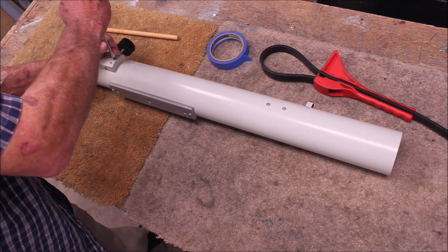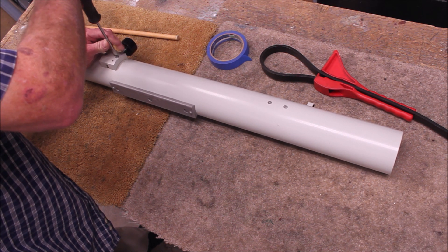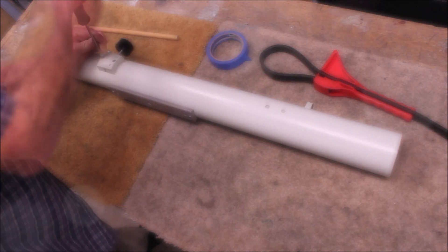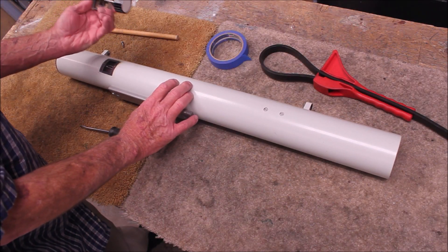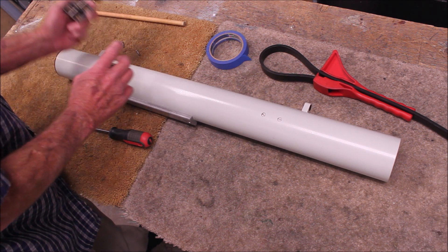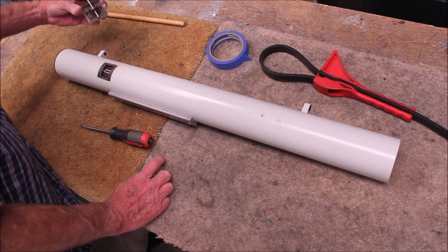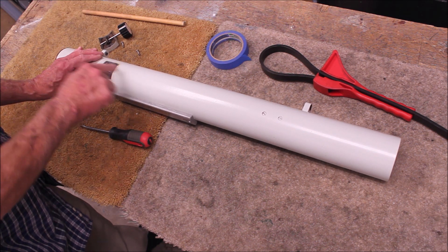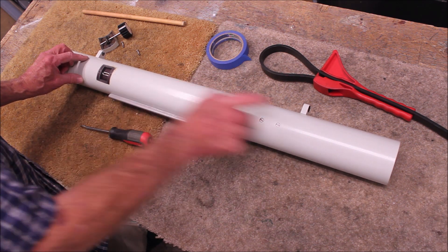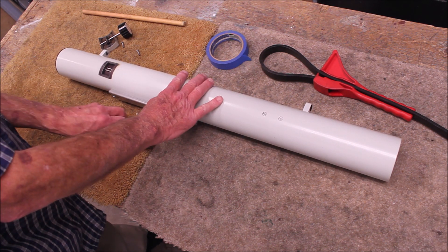The first thing we're going to do is remove this. Notice I'm not removing any of these other screws here. I'm not going to actually take that whole assembly completely out. All I'm going to do is remove the focuser and show you what I've got inside. Everything Zeiss does is built like a tank, so this is very well constructed. Inside here you'll see this does not have a gear — it's just a friction device, sort of like a strange Crayford. There's a track inside and that track holds a tube, and the objective is attached to the end of that tube, which slides back and forth inside.